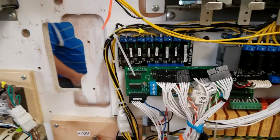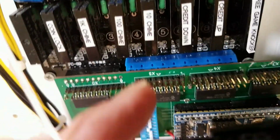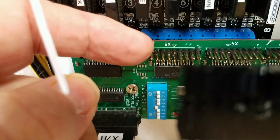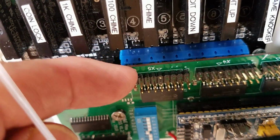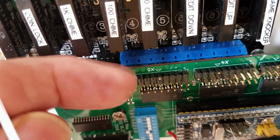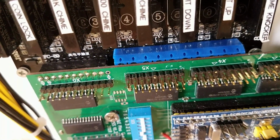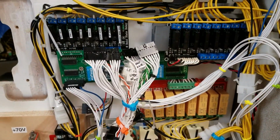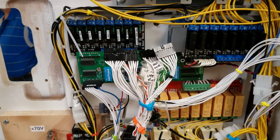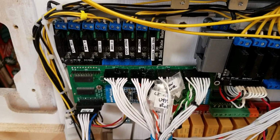Okay. Probably mentioned this to you guys before, but one of my intermediate fixes for this, and hopefully there's enough light you can see in here, but these little connectors, I can get my hand in here, are held in place with a little black plastic strip. It's about 1.5 millimeters, maybe a mil tall, and you can peel those off actually, but they're a little hard to get to. So what I'm going to do right now, after doing all this nice wiring, is remove that board and peel those things off just to get rid of these intermittent contacts with these connectors.